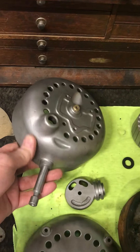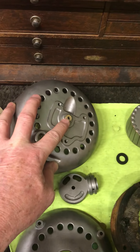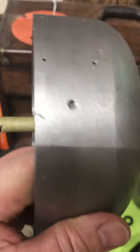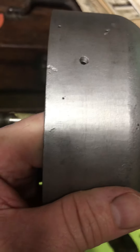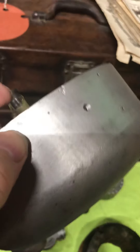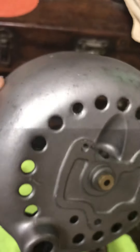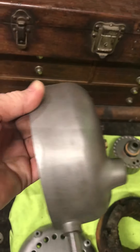I'm going to replace that brass bushing right there — that's got a left-hand thread. It's a little too tight, I can't get it out, but I'm going to put a new bushing in there. This motor housing is going to require a little bit more work. We've got some porosity right there around the edge and some pitting in different places, so we're not quite ready for paint. I've got to do a little sanding.